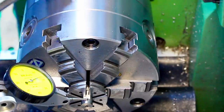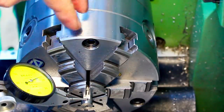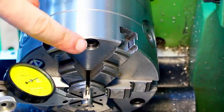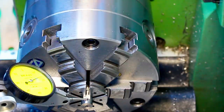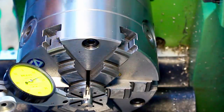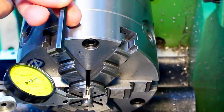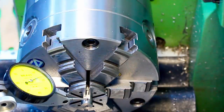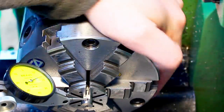And the way I do it, I tighten the screw, move the chuck. The chuck moves against the mounting screws. It slides despite being fully tightened down. Not a problem. There is molybdenum disulfide grease between the back plate and the chuck. That's a recommendation by Robin Renzetti, and it works marvelous. And once I did the adjustment, I backed the screw off, just a quarter turn, so when I use the screw on the opposite side, I'm not fighting this one.